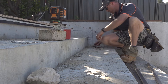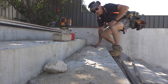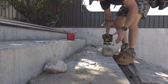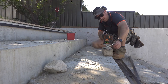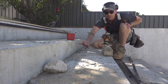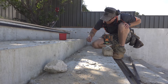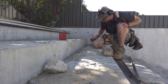So the way I'm going to put this strip on — first I'm just going to put a little mark for my height and then I'm going to use my laser. We just wind this up and down until we get the right height. I'm happy with that. Now we've got a green line for the top of that piece of ply. I'm going to mark it because once I put the ply there, I can't actually see the line properly.